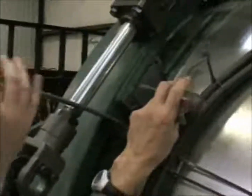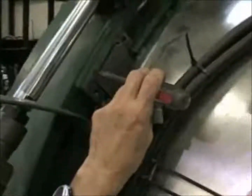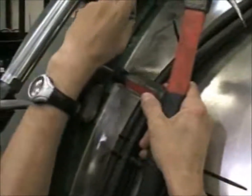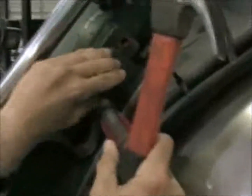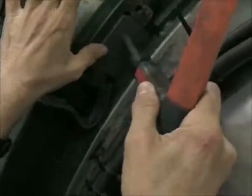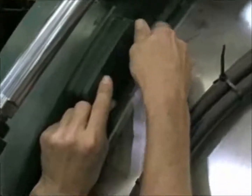A little bit of extra help with the pry bar and maybe a screwdriver to help lift the ring to create a gap between the glide block and the glide block holder to position the shims between the glide block and the holder, and then release the load, and the shim and the glide block should stay in place. Replace the cover.